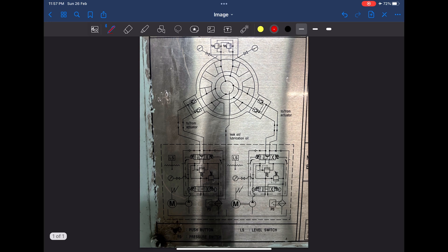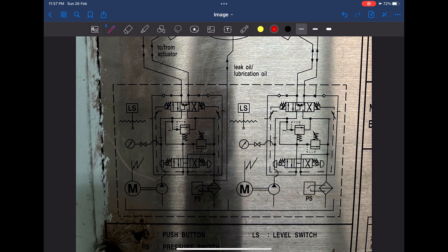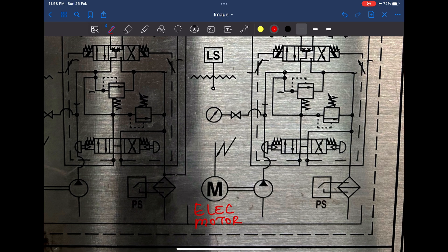This video is going to be helpful for marine engineers, especially those who find it difficult to understand the working principle of a hydraulic circuit diagram. So without any further ado, let's get started. Now look at the hydraulic circuit diagram of a rotary vane steering gear. First let's identify the individual components of the system. This is an electric motor, and this electric motor drives a hydraulic pump. This pump is a unidirectional fixed displacement pump — by fixed displacement it refers to the fact that this pump has a fixed capacity.